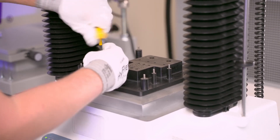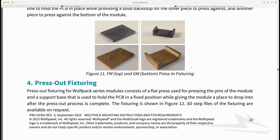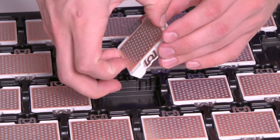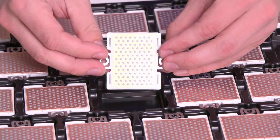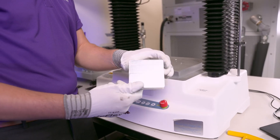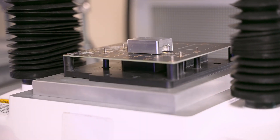Next, you will need a press-in tool designed with specific dimensions so that the modules are always mounted with the recommended gap between the bottom surface of the module and the PCB. If the modules feature pre-applied thermal interface material or TIM, you will need to develop press-in tooling with proper locating and tolerancing of the internal cavities to provide a sufficient press area. This will avoid interference with the TIM pattern.